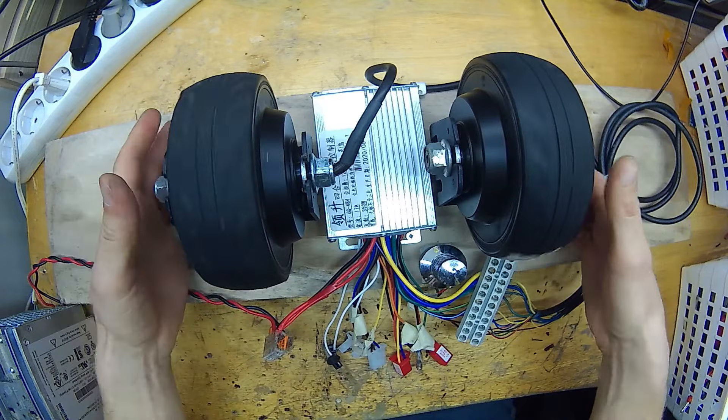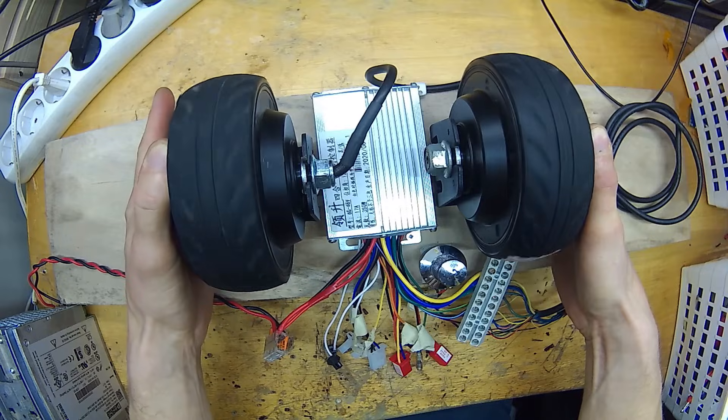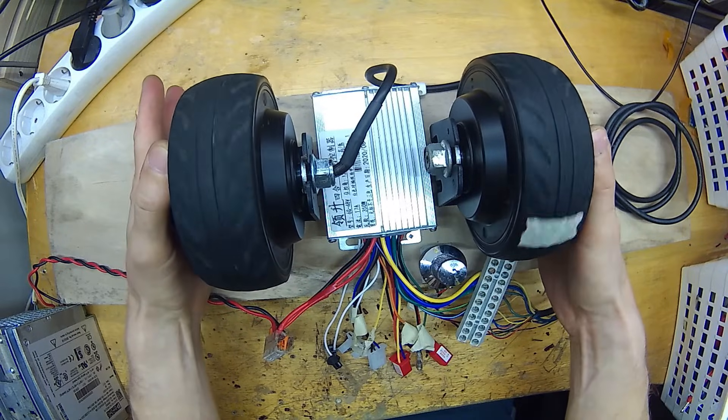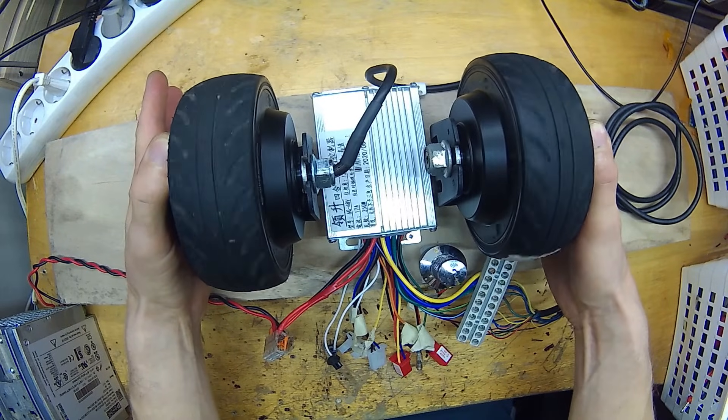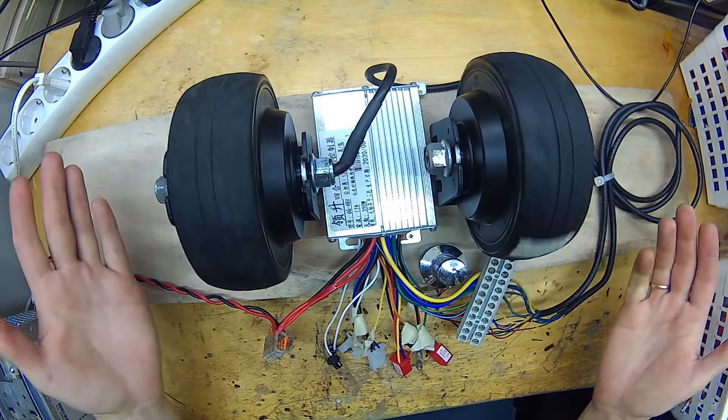Which makes no sense at all, since when this happens the controller receives two different sensor signals. In theory, when one motor is slowed down it should affect the second motor in some way — but the second motor just keeps spinning. When I applied similar resistance on both motors, they actually continued to give a lot of torque without problems. It wasn't perfect, there was still some phase dropping, but mostly because my hands can't deliver identical resistance to both of them, resulting in different rotation speeds.